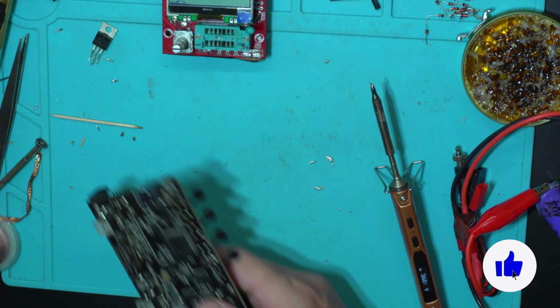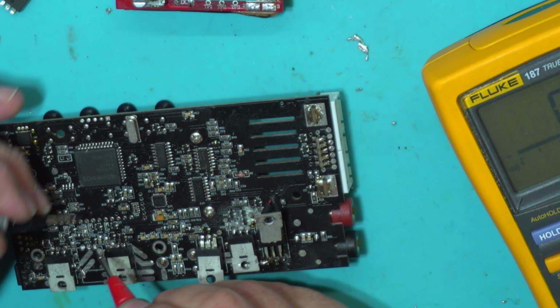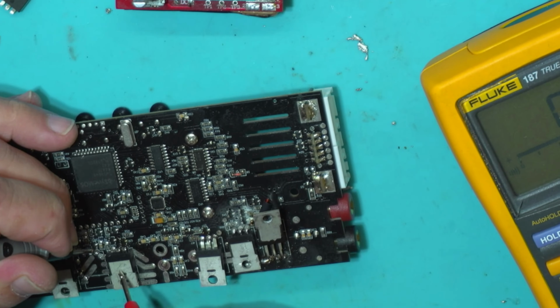So I fixed the discharging part of the things. Beautiful. Now, what's wrong with this? Let's clean around. Gate is coming from this transistor here. This transistor from emitter is going to this 1 ohm resistance to the gate. No short here, everything is fine. And this one goes to the source here, and this guy.